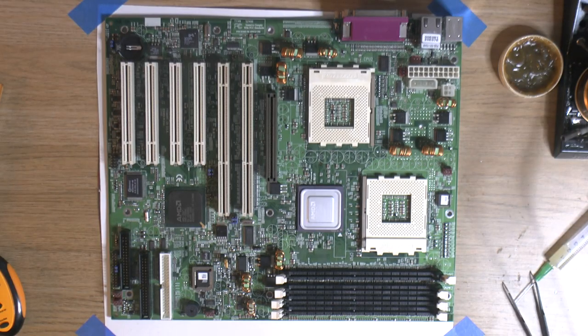The board is liberated from the old caps. They were quite difficult to get out. From all the socket A boards I've done, this was the hardest to do. I had to use my board heater to get it up to 90C or so. There was a chance to get them out, and if nothing else, to clean the holes.